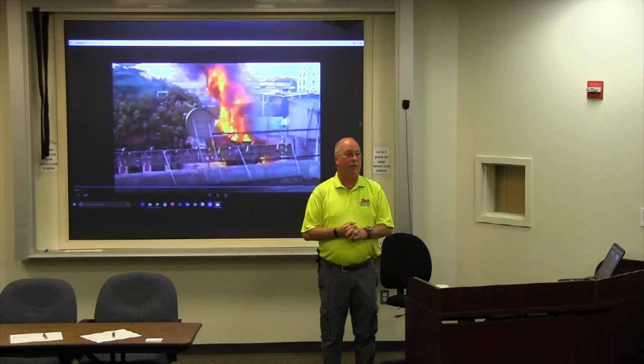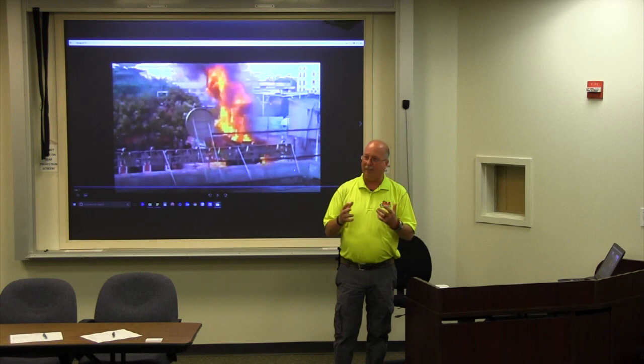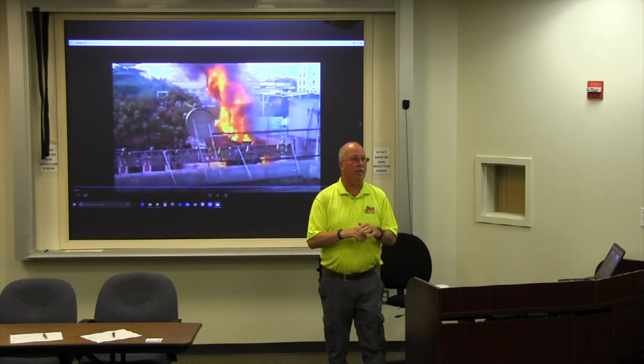Do you have a lot of problems with straw and hay? Not too much? Occasionally. Okay. Cotton? Okay. Those are going to be a little bit more difficult because those can start to become deep-seated, and again, while our product is able to do some amazing things, we have to get to the seat of the fire. So just because we're putting the fire out and we're offering some really good burn-back resistance, you still have to do your overhaul. Get to the seat, make sure that you got all the hot spots extinguished, and I guarantee you won't get a call back for rekindle.